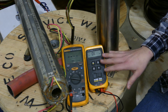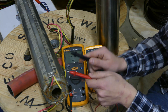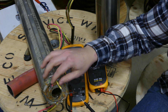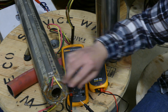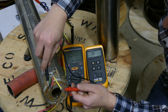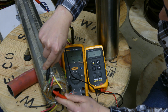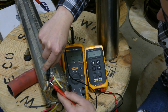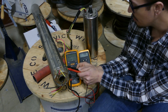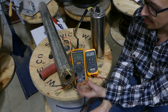We've got our ohmmeter set up here. We're set to 100k times value on the ohmmeter so that we're going to be able to pick up those finite shorts to ground. For example, we touch this here — we're overloaded, we're at infinity, no resistance. So if you remember from our last video, we're checking the insulation resistance, which means we're checking our windings — yellow, black, and red — against the ground. What we're looking for is a high number. You can see that the main winding, or the common to ground, is infinity; black to ground or main to ground is infinity; and red to ground is also infinity.